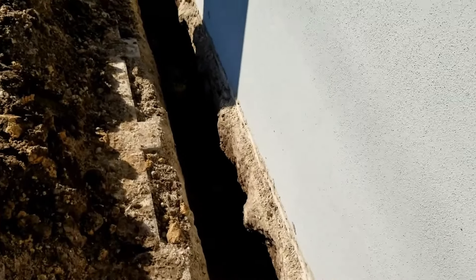So we've got it really nice and clean looking good. You do notice that we are in a sandy base and you can see all the water that's laying down in there — that tells me groundwater is really high. You can see what they've done here as they painted the stucco. It is a good paint but it's a sticky, sticky stuff. We've got to really get this sealed right here, right where the stucco meets this footer. This is solid concrete — not concerned about sealing that at all. There's no water getting up through there, but it is getting sucked up right along here, which was below grade. You can see where the grade line was right there, but for a permeable sand, you can see it's drying up quick — that water table is pretty high.